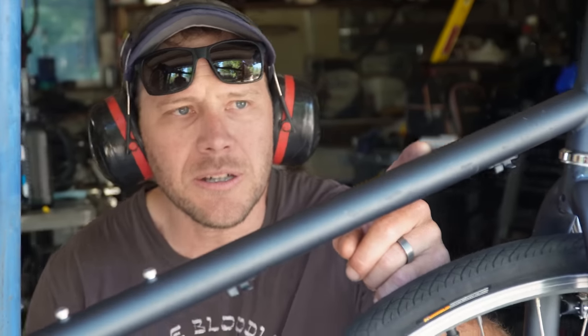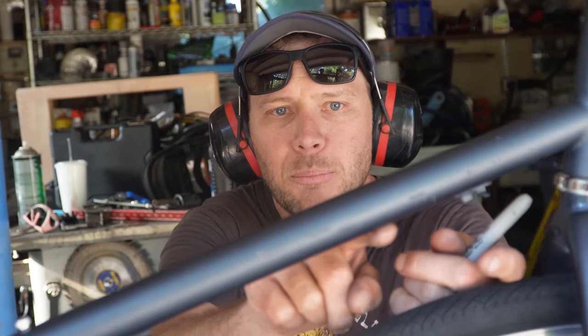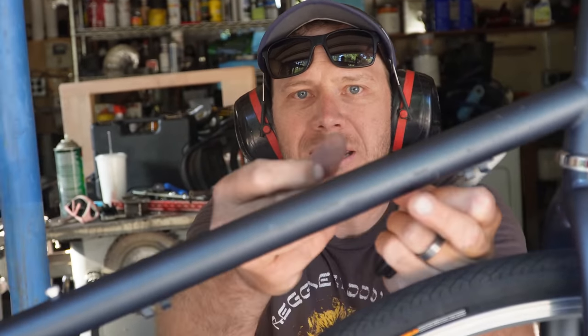All right. This is another little tip. We could completely cut this down tube and then re-weld it and redirect it. However, I've learned over the years that if you leave a little bit of steel on the bottom side and you just cut out a wedge from your tubing, you can change the angle and you never actually break that steel connection. You just bend it into place and that helps keep everything nice and straight. So, little pro tip, there you go. I like it. Take it or leave it. For all you swing bike makers out there.